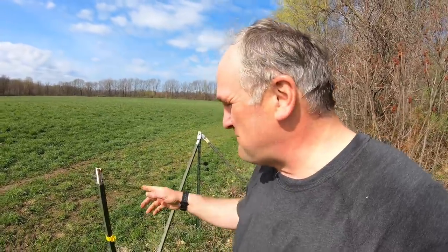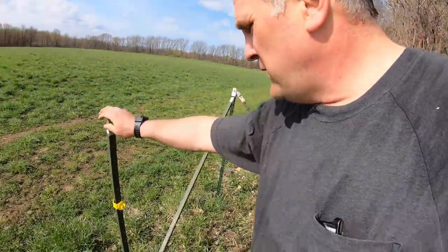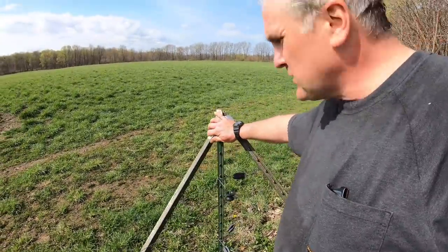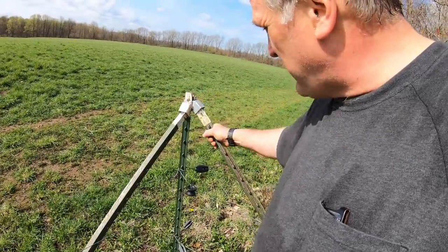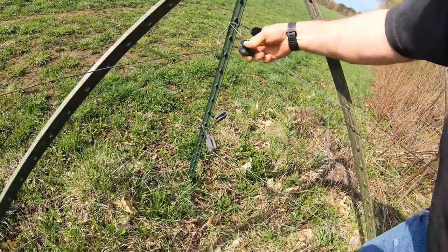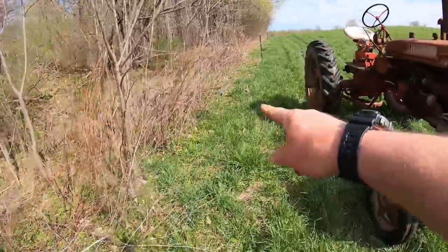So let me tell you how we do it. Our perimeter fences are just T-posts spaced at about 30 feet apart. We use these cheap insulators — yes, they do break, but they're easy to replace. For corners we use braced corners with an aluminum system. It's actually quite expensive for what you get and doesn't work very well, but it's what we've got. The corners are made such that the wire can move around them when we tension the fence. We use tensioners to keep the wires tight. It's a really easy-to-build and cheap fencing system: two wires, one at 36 inches high and one at 18 inches high.